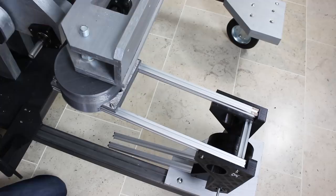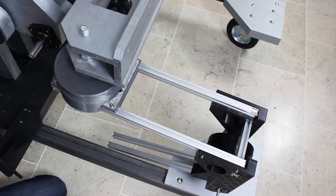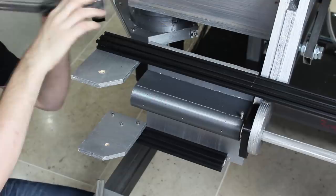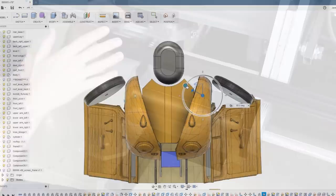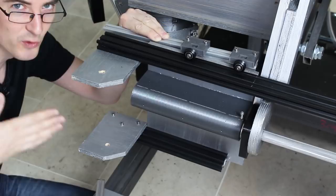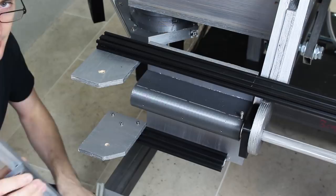Around the front of the car again — as well as this swiveling over as the transformer stands up, we need to make a thing that makes the wings slide in and out. They need to get narrower so that they basically make Bumblebee's chest, so I've got these sliding things with little V-wheels on there. We've got one on the top and one on the bottom, we need to link those together, and then motion-link that so the wheel also pivots outwards as the wings slide inwards.